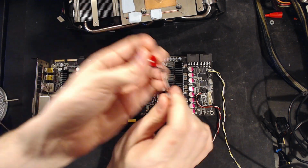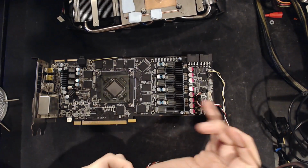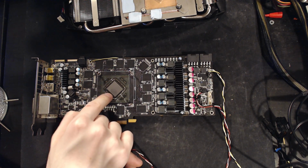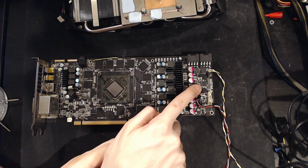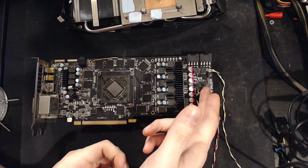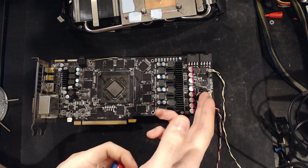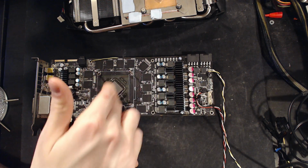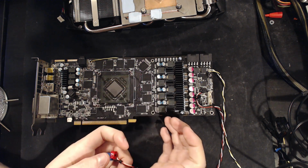And basically it's 3 wires because I disconnected the Vcore line. Because ultimately what causes that ridiculously low resistance that you measure is the resistance of a GPU core when it's turned off, like say this HD7970 is about 2.5 ohms. So if you measure from the pin on the voltage controller, then through the core and to ground, you get 4 ohms, because there's obviously some resistance from those 0 ohm resistors. One of them was 0 ohms, the other one was actually like 1 ohm. So not really much of a resistor, but still. Then there's some trace length, potentially some other resistor somewhere on the way, and you end up with something that has single-digit resistance because the GPU core is a single-digit resistor.